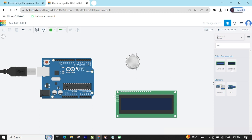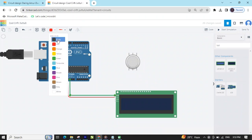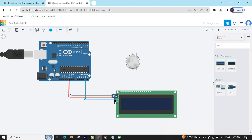There are only four pins. Now connect the LCD to the Arduino. The first pin is the ground pin — connect to ground. The second pin connects to the power pin, that is VCC. Also change the color to red, or you can change to black, because these are negative pins. The SDA pin connects to A4 of the Arduino.